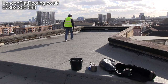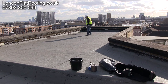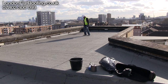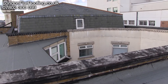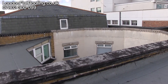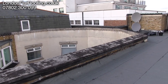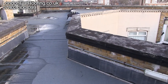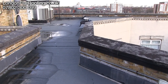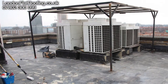Let's look at what the roof was like before we started. Over the top of the tiled roof there was a felt roof on timber decking. We made some inspection holes through it and were able to see that there were tiles underneath — this structure was a complete shambles. So we knew that at a bare minimum it had to come up. It was decided that we'd strip it off and then work out what we had with the tiles underneath.